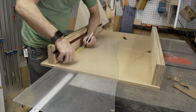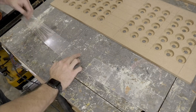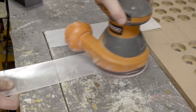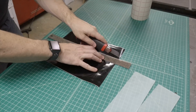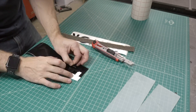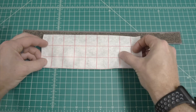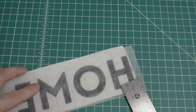Each one of these openings will hold a small piece of plexiglass with the team name on it. I had some really thin plexiglass and cut it down on the table saw. I pulled the plastic off one side and went over it with an orbital sander with about 80-grit paper to make it frosted. It wasn't quite enough, so I ended up sanding both sides. I laid out some simple text in Illustrator and printed it out on my vinyl cutter to make stickers, which act as masks when I paint the panels. I used masking tape to transfer the vinyl from the backing onto a new surface — it's a really nice easy transfer.